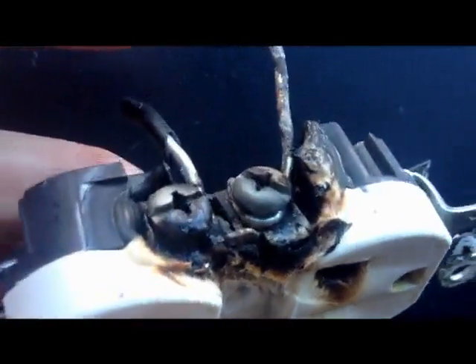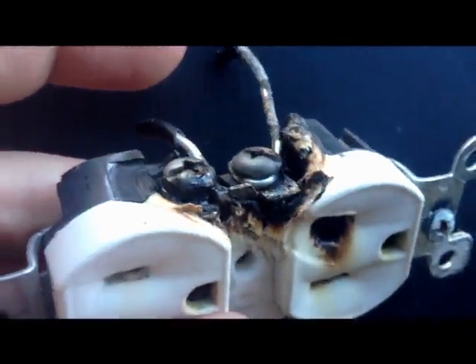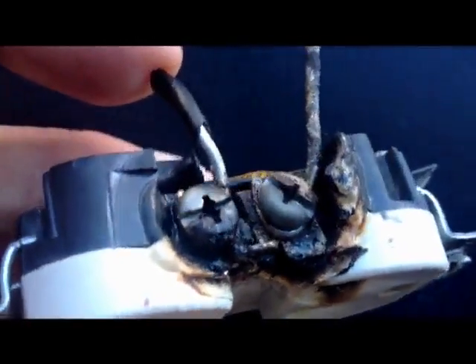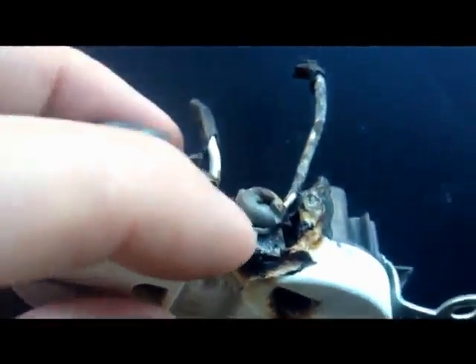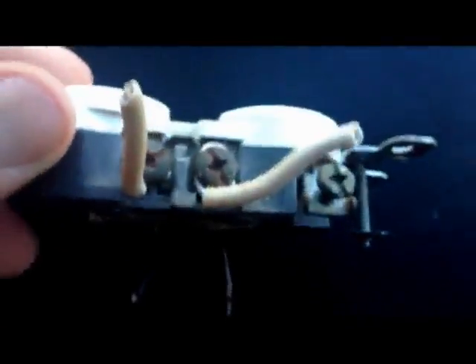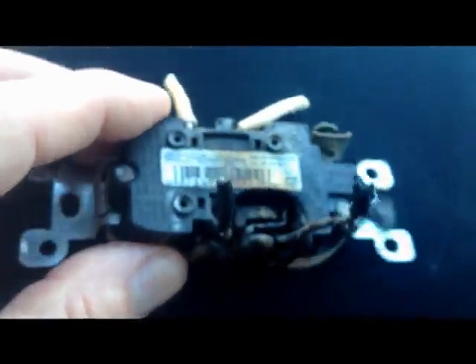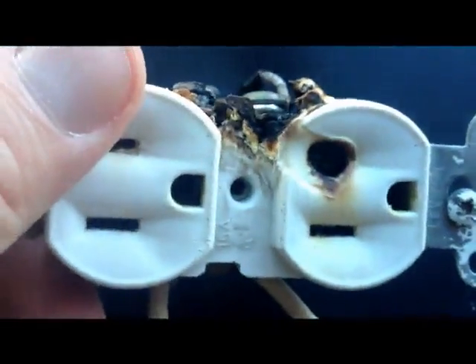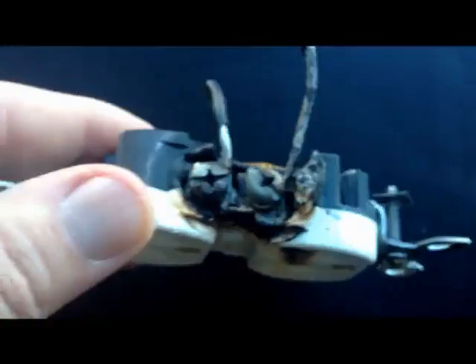That creates heat. In this particular case, although it did not start a fire that actually caught to the wood, it did burn obviously around here. This one here is not loose, and I don't know if the actual fire passed on to it or if for some reason it caught fire here as well. The other side is fine. These are just the neutrals, and this is the load side — the power that was being carried through. You can see there are four wires coming in and out of this outlet, so even if it wasn't being used to draw power itself at the time, it was passing power along to other outlets. That was likely the case here, and that's what caused it.